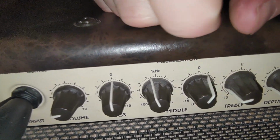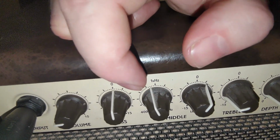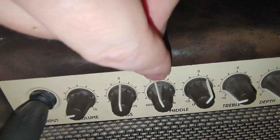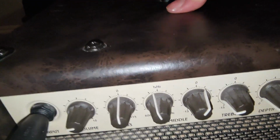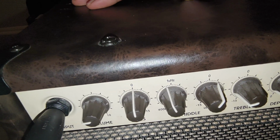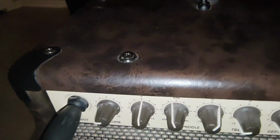Now this was not adjusted at all, this stayed exactly the same. So that means that I got more on frequency by going off dial, which means that this probably has a bit of wear in its tunable cavity or whatever frequency select or filtering circuitry is built into the mid-range. Now I wonder, if I continue to go off frequency, will it continue to increase or will it decrease?